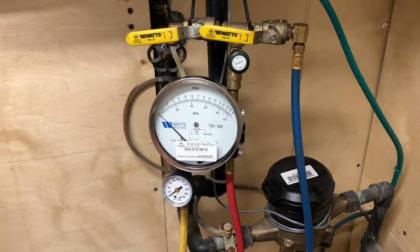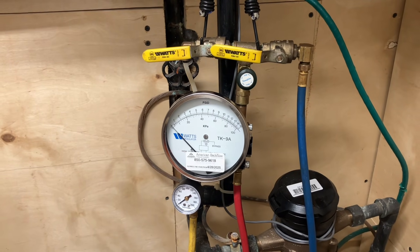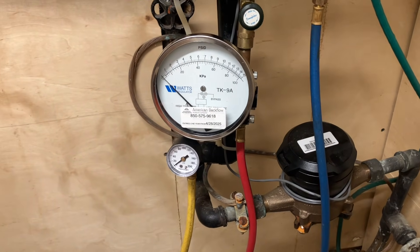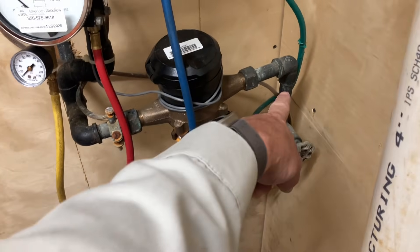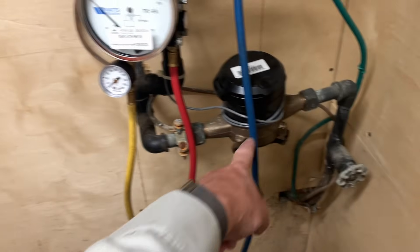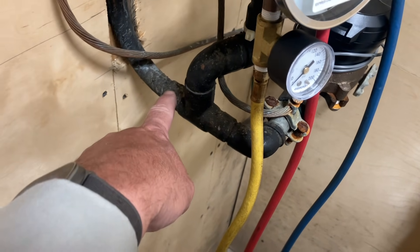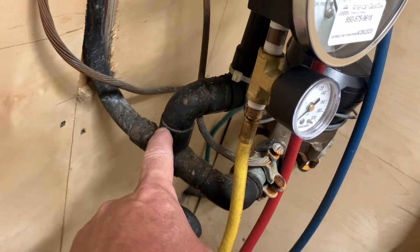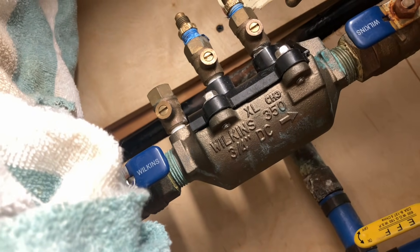When the Watts TK9A comes out of the box, you know it's going to be another boring video. Hopefully we'll put a little spin on it because now I have a pressure gauge on my TK9A backflow tester. Here is a 5/8 residential meter — this is a 3/4-inch water main coming up. Our direction of flow is here going up. There's a T here — a 3/4 by 1 by 3/4 copper sweat T. This line is domestic water feeding the house. This one-inch line goes up and feeds the irrigation system, the lawn sprinklers. We have a Wilkins 350XL, 3/4-inch double check valve.